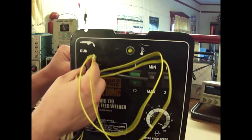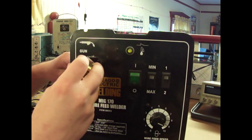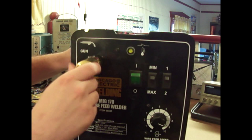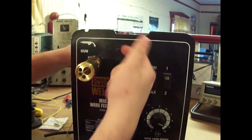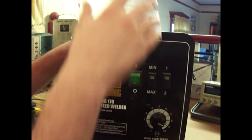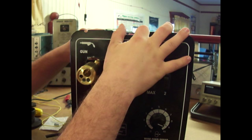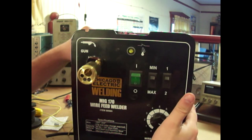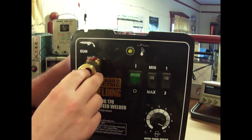That's perfect right there - I've got space all the way around. You want to make sure the actual threaded brass part isn't touching the case, because if it is, when you pull the trigger this whole thing is going to be at the same voltage as the tip of the gun. If the ground lead hits the case, or the connector bumps against the welding table, it could short out to the case. So make sure you've got a gap all the way around - and we do.